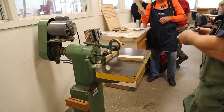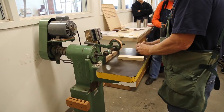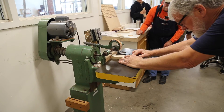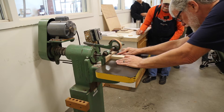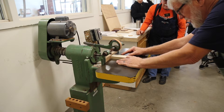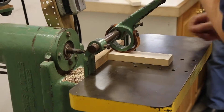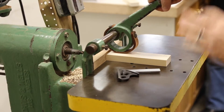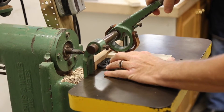I take a square. I align my pencil mark, then I put the square up against the fence and the workpiece to guarantee that the piece hasn't cocked off crooked. Before I go to drill, I want to look at that square — I'll position it so the camera can see — to make sure the piece is absolutely perpendicular to the fence before I try and bore the hole.